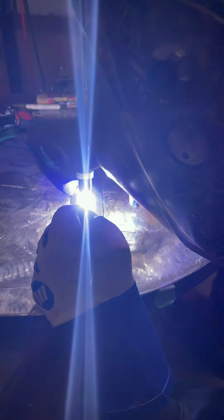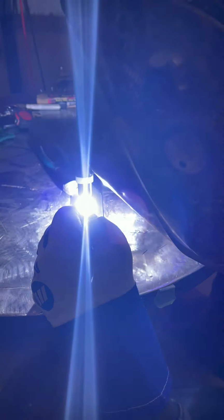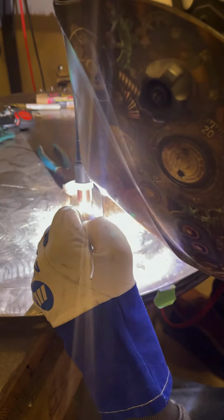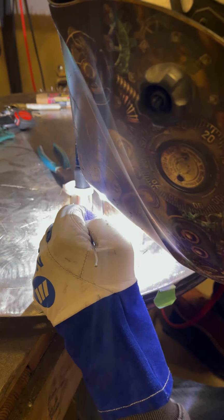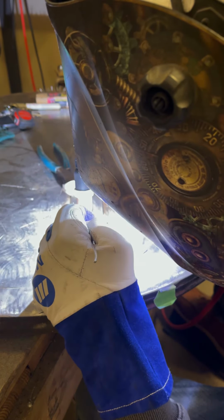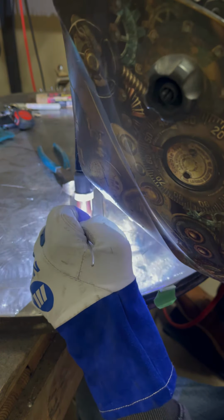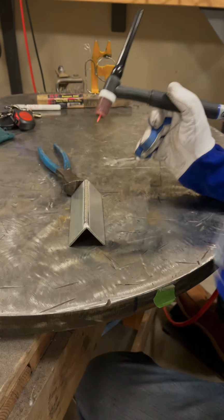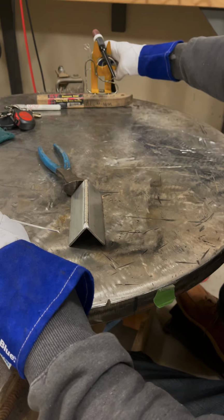I know that in the original picture that I posted, the guy wanted a solution without adding more heat. Maybe he only has a 135 amp TIG welder. Well, one of the things you can do is go even slower than what I'm doing. And if you saw, there wasn't any penetration in the weld. Had I slowed down and let that weld pool sink a little bit, the penetration would have been better despite not having more amperage. Or you could preheat the material.